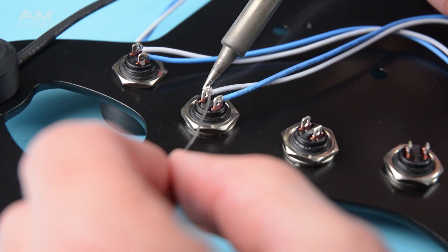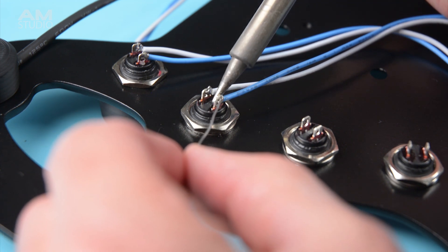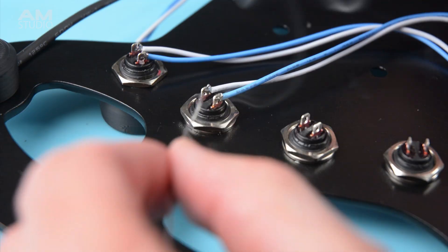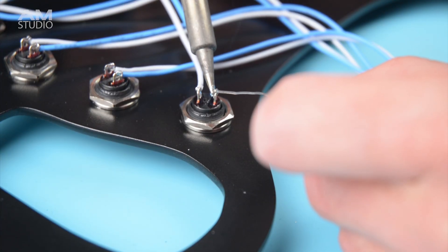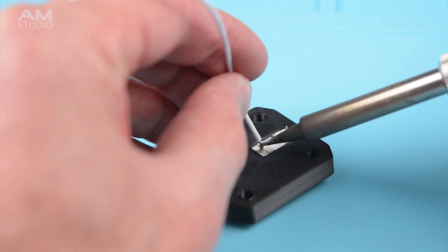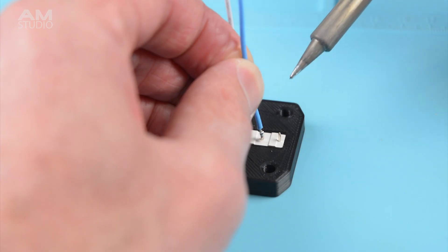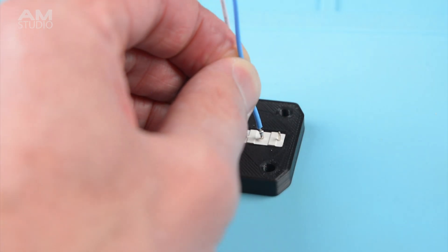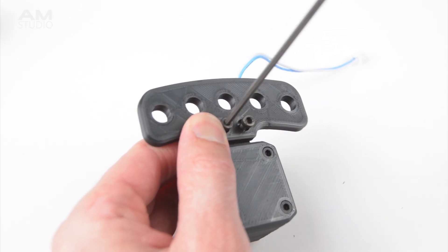With the top two buttons complete we can begin working on soldering the remaining 8 buttons. These ones don't require heat shrink or covers as they will be inside the main enclosure. The paddle shifter components are 3D printed then wires from the joystick encoder kit are soldered to the common and normally open terminals on the switches. Then the paddles are installed to the magnetic shifters.